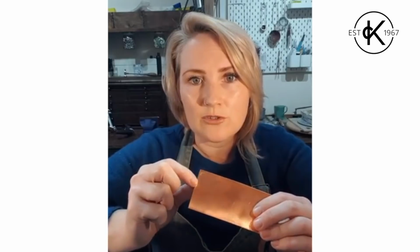So I've got another way, which I'll talk to you about in a second, but if you did want to do the traditional method and you don't have a scribe, you can use anything sharp and pointy. You've probably got something around the house like a pair of dividers or a compass, or you could use a little tack, nail, screw, just something that's pointy, sharp and has a flat end to it. We talked about centre punches the other day, so again you could use those.